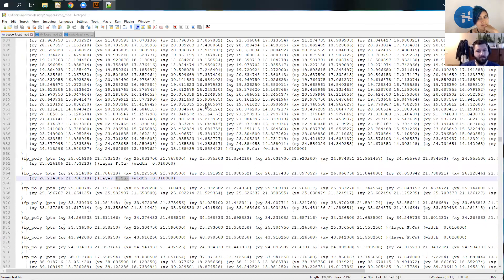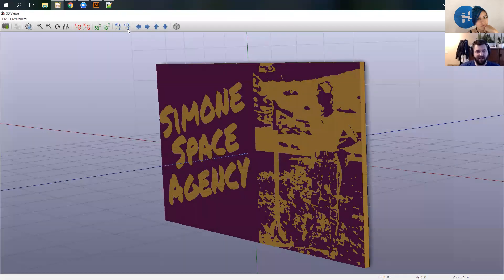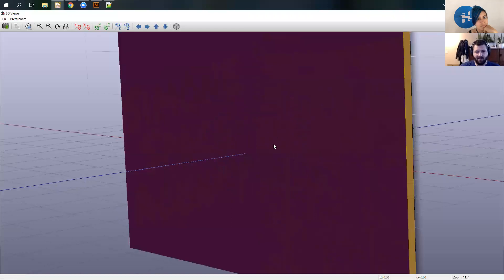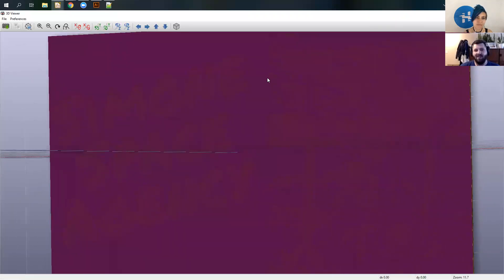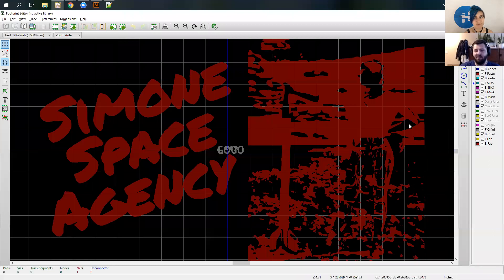To confirm that: I loaded the copper layer and it's all on the mask layer right now. If I reload after the text change, it changes color and I'm now on the copper layer. Basically by changing that text name, you can change that shape to any one of the available layers. If I want it to be back side copper, I would just use 'B.Cu' — the capitalization is important. You have access to all these different layers even though the GUI in the other program doesn't specify that. You actually have access to the edge cut layer too, so you can make holes and different footprint outlines.